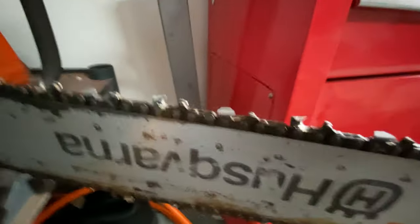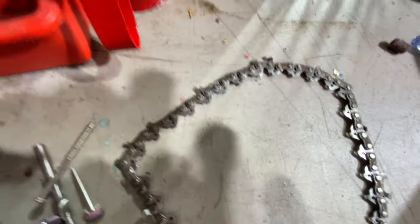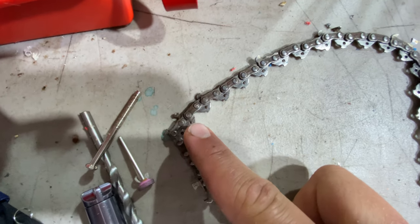We're sharpening some stuff here. On the Husky 450 we got the full house chain back on it with a fresh file. We got Kyle running a power saw and he was doing some rookie stuff, but he's learning very fast — way faster than any guy I've had help me on trees. He was using a skip tooth chain and turned it into a really skip tooth — tooth, tooth, no tooth, raker, no tooth, raker, tooth. He was hitting the ground with it so we pulled that right off. His filing was good but it didn't stay sharp long and started producing sawdust.